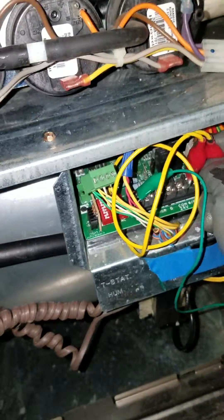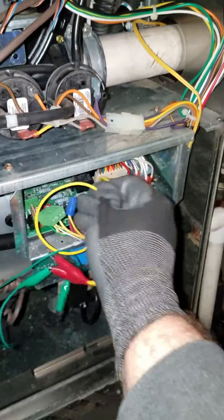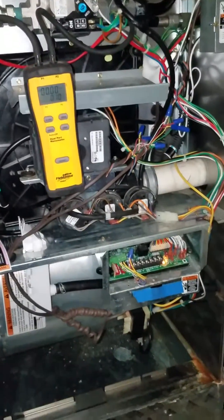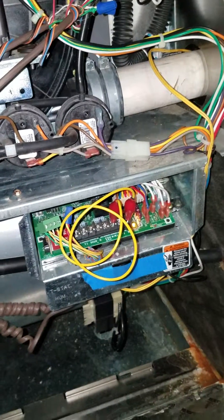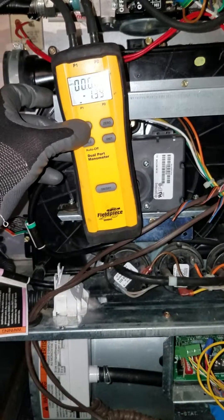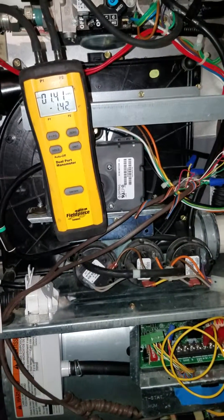The instructions say to take it all completely off, wait for everything to shut down, and then put it on to low and adjust low if you need to. Hot surface igniter's on. Now, when you fire it up it always starts in medium unless it's going straight into high. So I have it jumped on low W — it's going to start on medium. We already adjusted to 1.41. So now it's going to wait 90 seconds until the blower kicks on, and once the blower kicks on then it'll drop down to low.